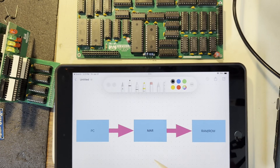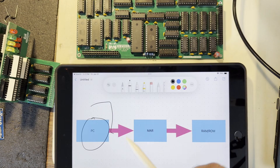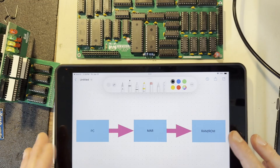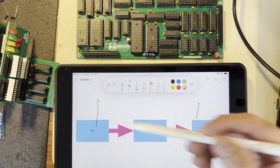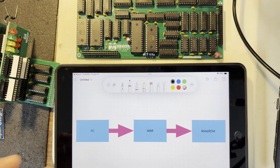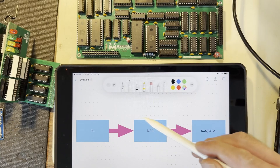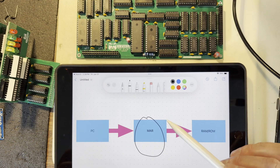Generally speaking, your textbook implementation of the MAR looks something like this, where you have a program counter — or it could be anything from the data bus really — feeds in through the data bus to the MAR, and the MAR acts as the middleman between the RAM and the ROM. This is a common configuration for computer architecture and helps solve issues with speed disparity between the RAM and the rest of the computer. But because I decided this computer is not going to ever run very fast, I decided to repurpose the MAR from its original intention and add a lot more functionality onto it.